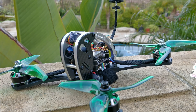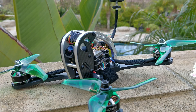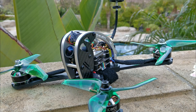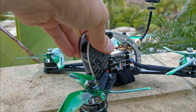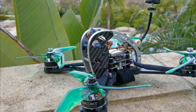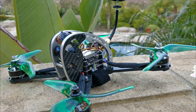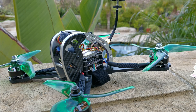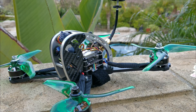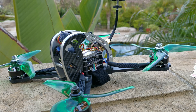The flight performance of this quad is pretty awful, and it's awful because of a couple of main reasons, paramount of which are the motors. The motors are really weak — the construction doesn't seem too bad, but the quad is just way too heavy for that low of power output. That's probably exacerbated by the fact that the ESC board cannot probably deliver the amps necessary to properly allow the firmware to give you a good tune and good flight feel. It's definitely not an easy quad to fly — it's actually very difficult. I only flew it for one pack because it was so awful. I could learn to fly it well, but it would take time, and this is me after three years of flying. I can pretty much pick up and fly most things — this was a genuine challenge.